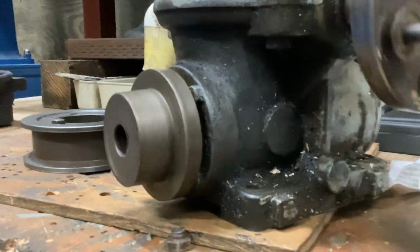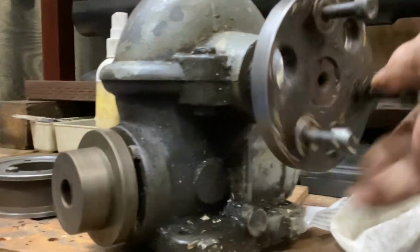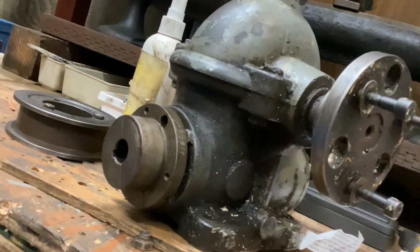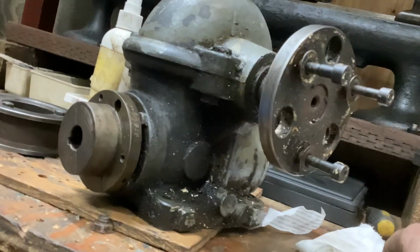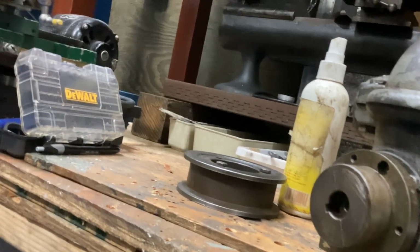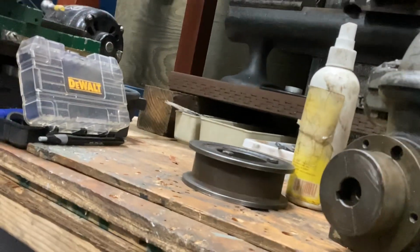Okay, our motor will connect up to this valve. Then the plate goes on here. Nice and slow I want it as well. That goes on a plate. And up and down I want it sort of like a hinge. And a screw jack, so that I can control everything by just turning the screw jack, lowering down the cutting arm, slow as I want, and do my own cutting. Kind of universal power hacksaw system.